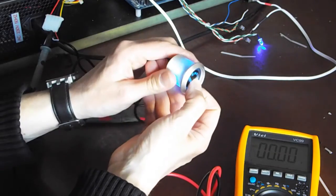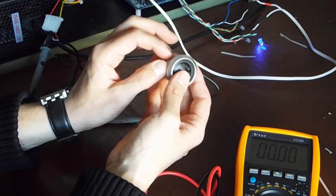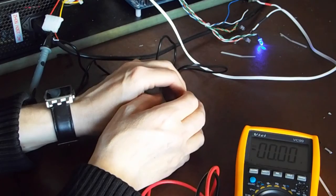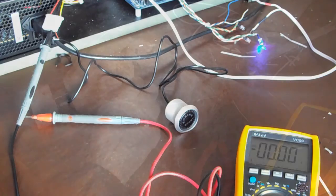But looking at that, you've got a circuit board there. I might be able to drill into that, just put in a little blue LED so that lights up all the time. So maybe all is not lost. But good job I checked that, because I don't want to start whacking 12 volt DC into those little controller boards. There we go, something I can mod, something to get on with. Right, we'll crack on with that.